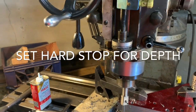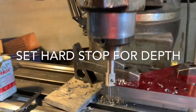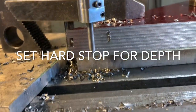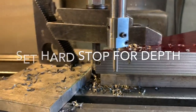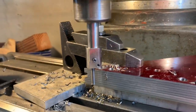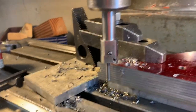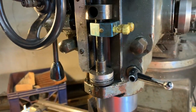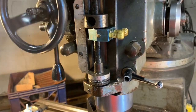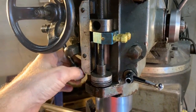This will be powered when I'm running, but there's also a nice feature here since my boring head is a little bit too short to clear the one inch. I need to stop it ahead of time. I have this stop here, and the way this works is as this thing is turning, it comes down and then it disengages.